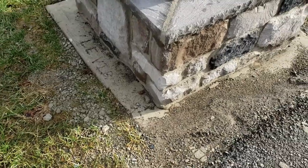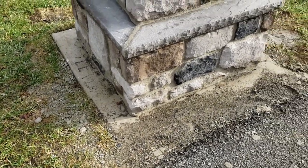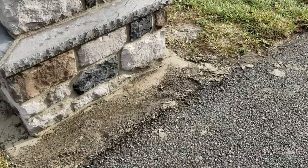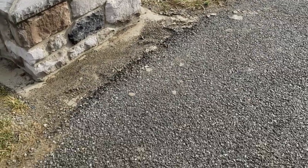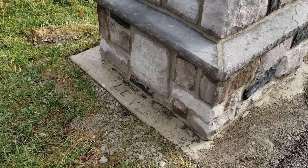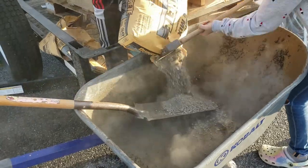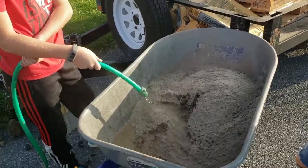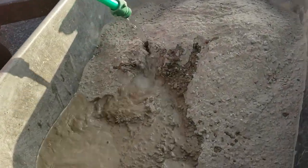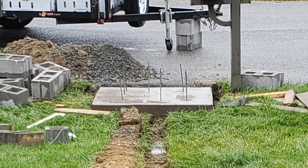In this case, I only dug it about 15 inches deep and hit solid ground, and I think it was from the base of the road. You don't need to get through that solid part because it will be nice and solid for you. Once you get the concrete all mixed up for the footer, you'll get it all leveled out and then put in some rebar in the ground or into the concrete to reinforce your first two rows of block.